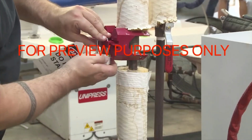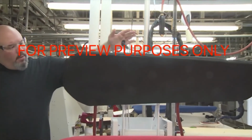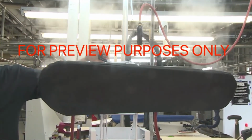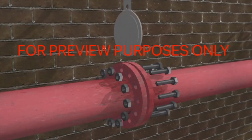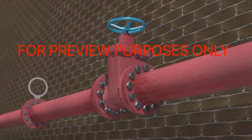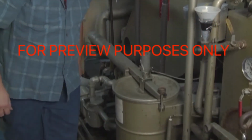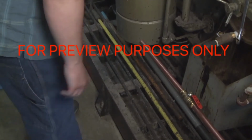Remember, just like stored electricity, existing pressure in hydraulic and pneumatic lines can also be hazardous. So you should bleed any pressurized lines before beginning work. Pipe dividers, called blinds, are useful when you're working with particularly complex hydraulic systems. Blinds enable you to segment the system. Then you can bleed one section at a time. This provides the best protection in these situations. A good way to test the effectiveness of your lockout on hydraulic and pneumatic systems is to look for downstream valves that you can crack to see if any pressure still exists.